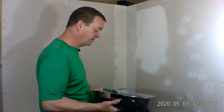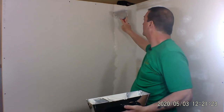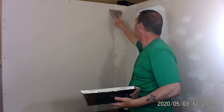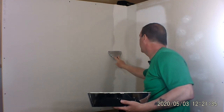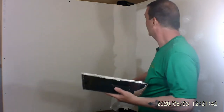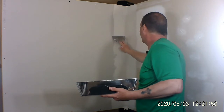That's how it works. So let's do this side here. Can you see me okay, Oka? Yeah, you can see me okay. All right, so two finger. I'm gonna push a lot on my left-hand side and glide on the right-hand side. 50% off of the mud, 50% onto the mud, and go straight down. And there it is. I got a little bit of a line, and I'm just gonna lightly go over it. Two finger gliding.